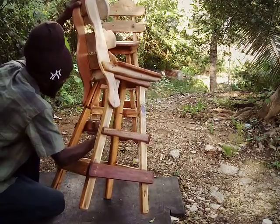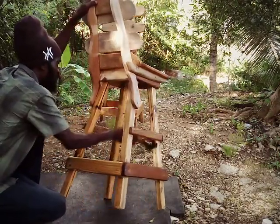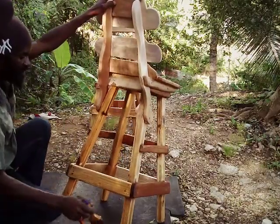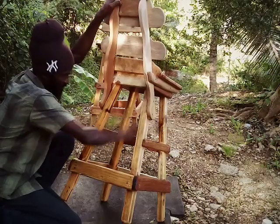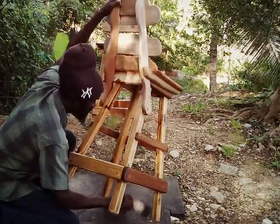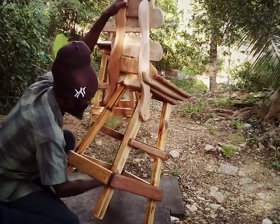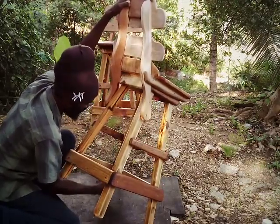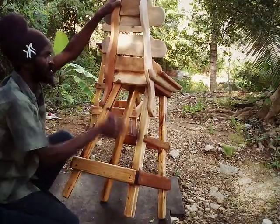And when you put on that sealer and you allow it to dry for a while, then you're going to rub it off. So because of that, you could do this. You could brush on the sealer at first, or the varnish, anything. If you're not even going to seal and you're just going to varnish straight ahead, you could do this.